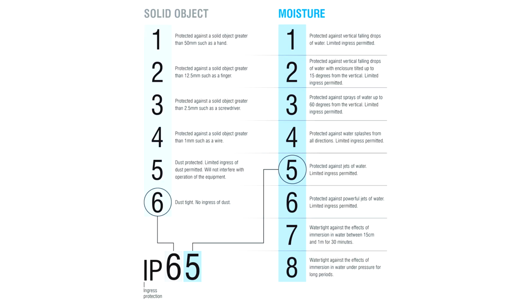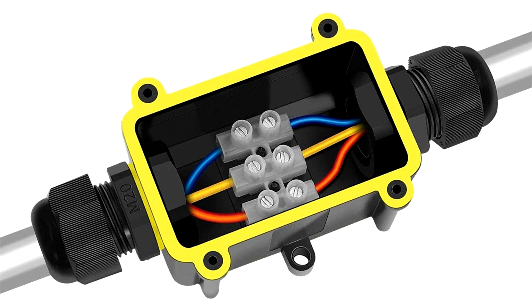But for example, I have a joint around my sink area. I've made sure that joint is a full watertight joint. It's not that expensive to buy them in ones. You can buy a small box of them and it's just going to become useful when you're wiring your van. Definitely don't start using spade connectors under your sink. That is just a terrible idea, and it is a sure way to have problems in the future.